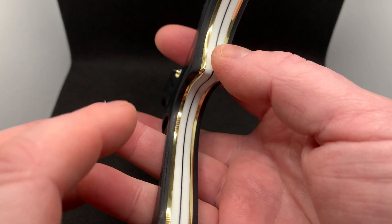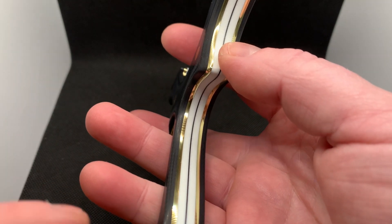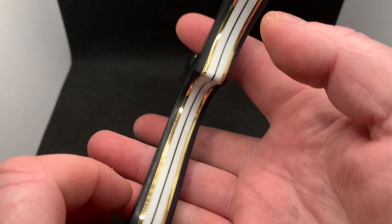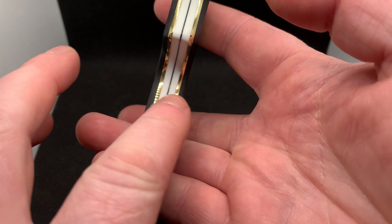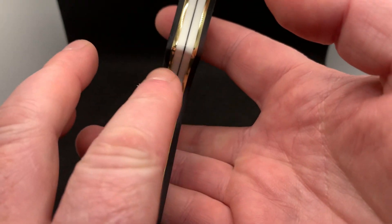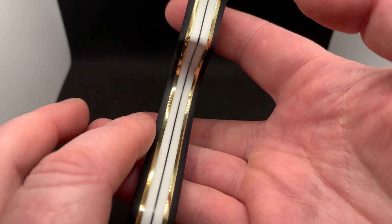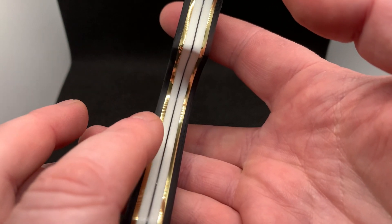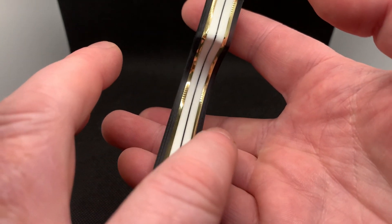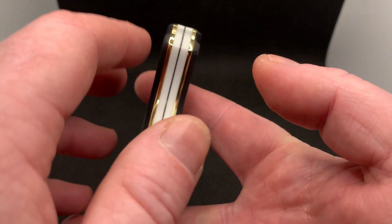I'm used to doing half a millimetre liners — I like thin half mil liners; they're easy to work with, easy to cut. This 1.5mm was harder to cut and just harder to work with. The reason being it's hard to get a completely smooth feeling on it. The G10 is hard as it is but it's softer than 1.5mm brass, so when you're sanding the G10 goes down but the brass won't. There are a couple of places, like up here near thin parts, where it'd be near impossible to get it perfectly level.